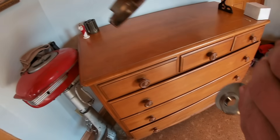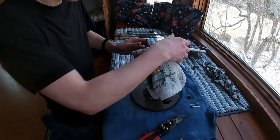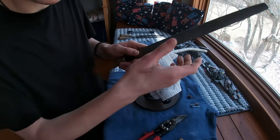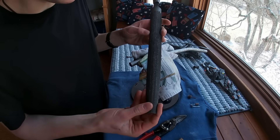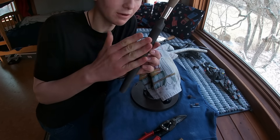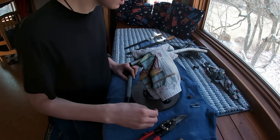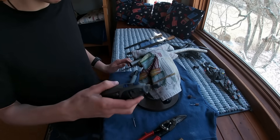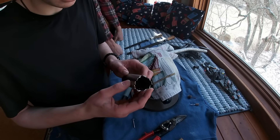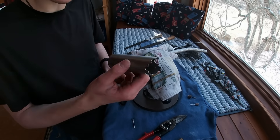It'll save maybe 30 grams total doing it on both sides. So you can see we've got a little bit extra there. We usually like to start the mitering process with this larger file — I have no idea what the curve on it is; it kind of changes along its length. It cuts like a saw, it's pretty aggressive, so we usually rough it in with this guy. Then we'll switch to this file, which is a little more fine. Then we'll go to this rat tail so that we can get more detail work. We've got some sandpaper we'll use at the end, and the drum wheels to get the chamfer. For the bigger miters, we'll drill a lot of holes like this one — this is off the down tube. We drill a bunch of holes and then connect the dots with a saw to cut off the excess.